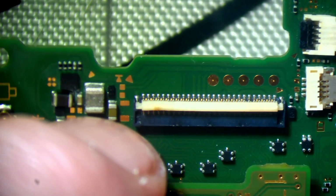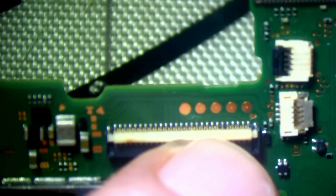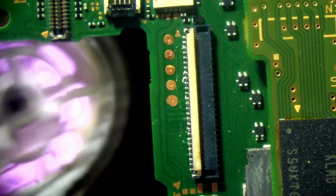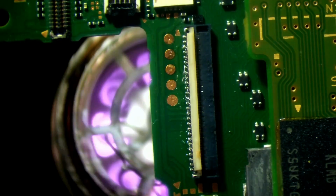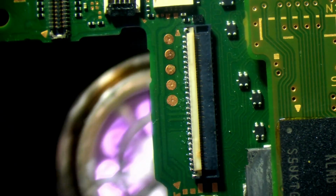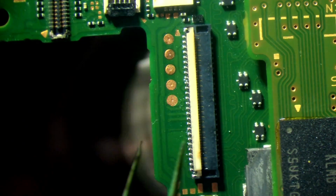Just there, we've got a pin which appears out of place. That LCD connector is going to have to be replaced. Yeah, you can actually see it there as well, look, where the pins are damaged. Oh, that's annoying. I'm going to drop my temperature down because this is a really sensitive part of the board where it popcorns a lot unexpectedly, and I want to reduce that risk.